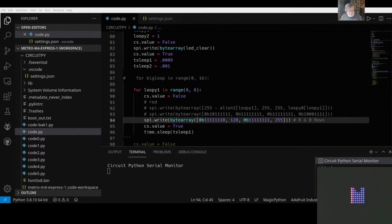So now we can actually see. So we have blue here and red there with blue in it. You can actually see the 2 pixels are actually on in there. Okay. Now, what happens if we change this 128 to 129? Now you see this became completely red. So 4 bits are actually controlling the color. If we make this 1, we've turned on this row. We make it 128. We've turned on this row. So you can see in here that we are doing position. And making the position change is making the color change too. Because now we're positioning everything under with the red turned on.